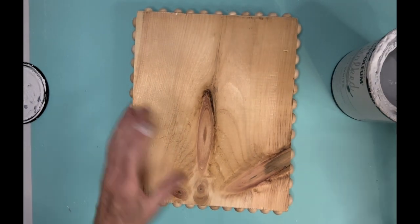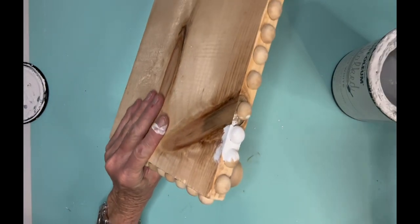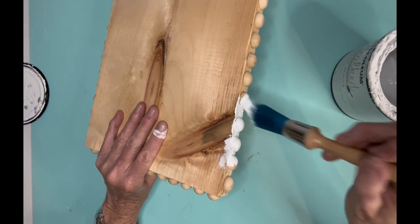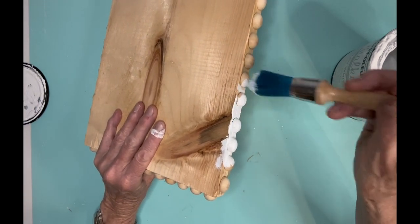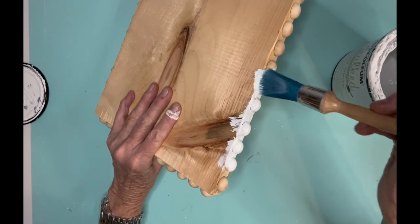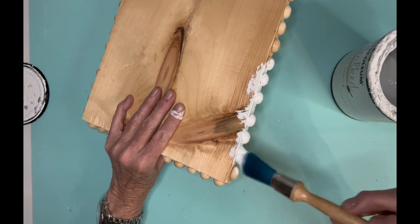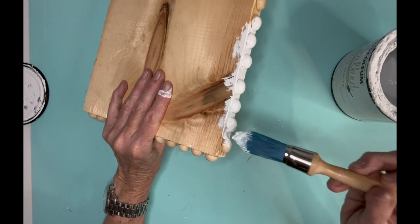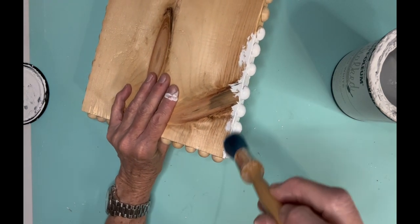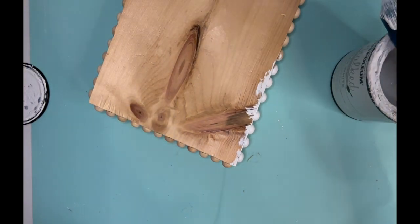It's not the best piece of wood — it's got some knots — but I go ahead and seal it first on the top so none of the tannins will bleed through. Then I put about three coats of Rust-Oleum Linen White chalk paint on it because I want it really white so none of those dark spots show through. Then I carefully go around and paint the beads, top, bottom, and legs — paint the whole thing white. It's really short, so nothing tall would sit on it.